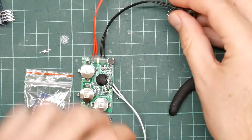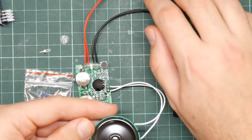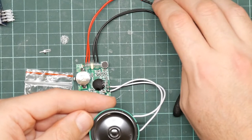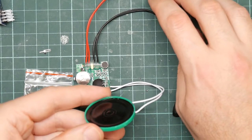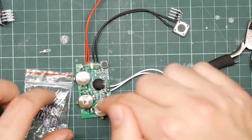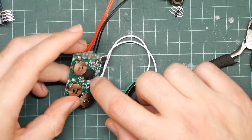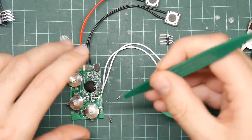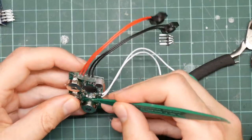So, playback. Nothing. Play. That's a record, rather. Yep. The beep means it's starting to record, and normally you press it again and get a double beep. But it's clearly failing to talk to the flash chip and just giving up. It's crashing. If there was any tracing, it would be dumping error messages. Okay, let's try some bits of wire then, shall we?